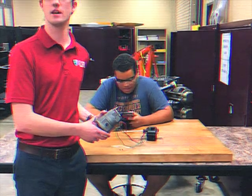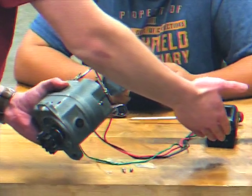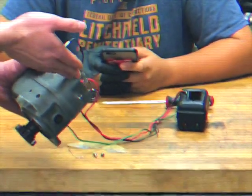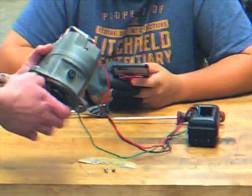To test the internal timing of the Bendix S4LN-21 magneto, connect one of the colored leads from your magneto timing light to the primary lead from the S4LN-21. Upon turning the rotor, the points should open when the red chamfered tooth lines up with the inspection window.